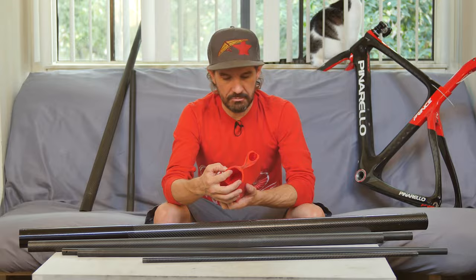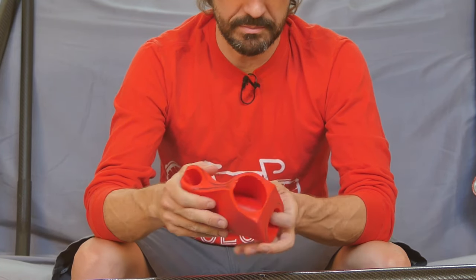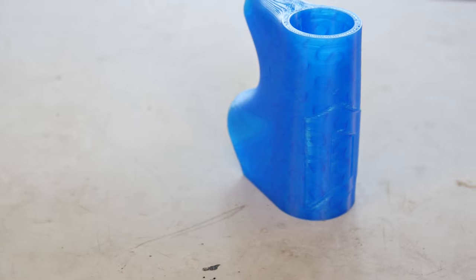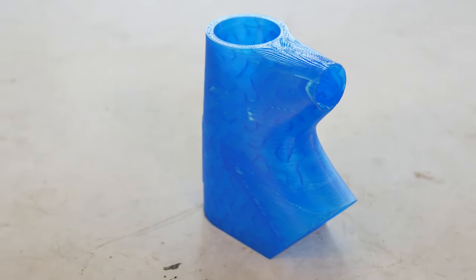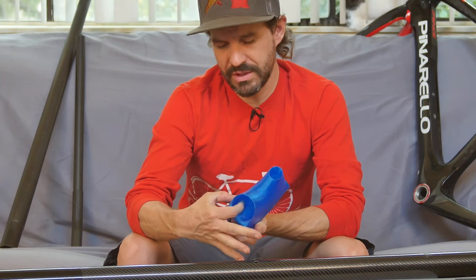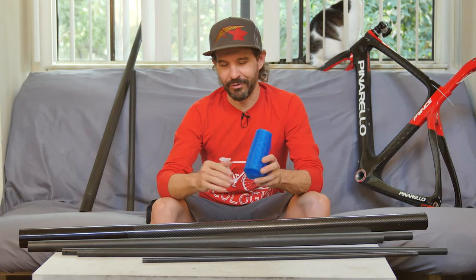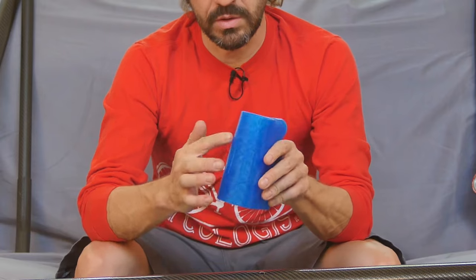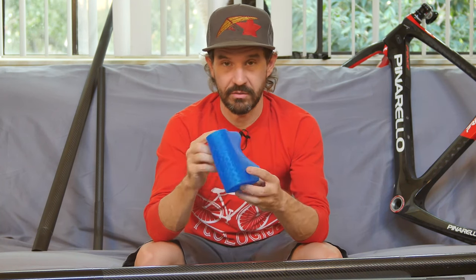This part told me a lot. I don't need as thick of walls on the outer section; the wall thickness can taper to be thinner, and I don't need as much thickness there as long as there's a lot on the inside. Also it doesn't need to be flat on the top — that was just a first draft. V2 of the head tube I didn't even print; I went right on to number three. You can see a much more elegant, flowing, curvy design — my surface modeling skills are starting to come into their own. The wall thickness for the tube ingress ports tapers thin at the edge, so better use of material. I have an embossed logo on here — the D in the Dave Build Stuff logo, of course that has to go on there. And then on to the fourth iteration, where I'm refining the tube fit geometry, logo placement, and overall print quality. Pretty satisfied with how that's looking — a very cool part.